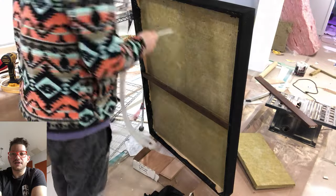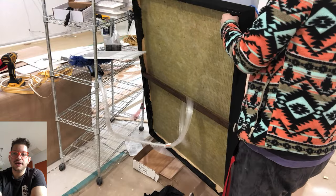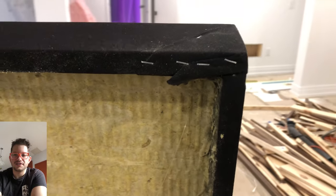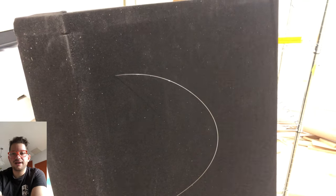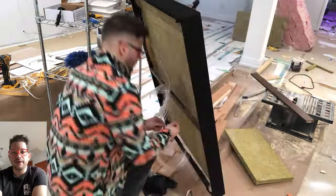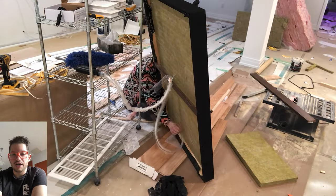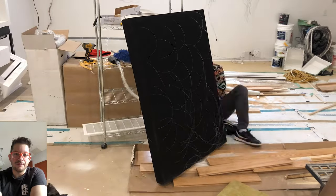So here are all the fiber optic filaments and we can go ahead and poke them through the panel. A little tip: I like to use scissors and cut each filament on a 45 degree angle just to give it a sharp point, because that sharp point makes it easier to poke through the acoustic insulation and through the fabric on the opposite side. There is the first filament going from the light source all the way through the acoustic insulation and poking through the fabric. You want to pull a good amount of slack through the fabric side, because once the panel is installed we'll cut the filaments flush with the front face using scissors or nail clippers, and that's what allows the light to emanate right from the panel itself.